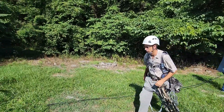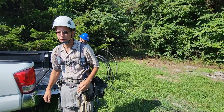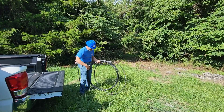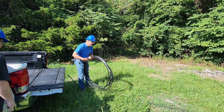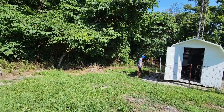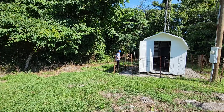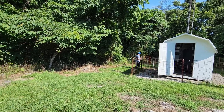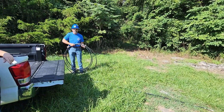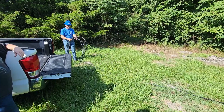Those have been working great. Our Echolink and our All-Star connectivity — everything on that end has been working great. But if you came directly into the repeater with a tone of 77 hertz, no bueno. So we're going to go ahead and replace the cabling and replace the antenna on top. We have a GP1 up there — maybe it was damaged, we weren't sure. We hadn't been up at the top to even see. And we thought, while we're here, let's go ahead and put a GP3 up there. It'll be a little bit better, not that we really need it because we're in a great location.